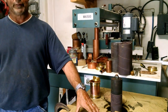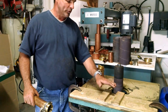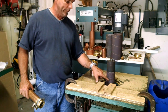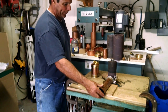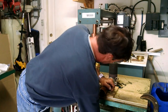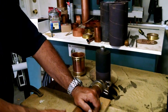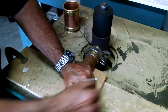I've actually made a jig for this oscillating sander. These cleats I put on here are perpendicular to this drum, centered up under this drum. I've got a line here that's centered it up. So I'll set that thing right on there like that, and as I continue on and start to put a little force against this thing — I'm going to show you when I turn this on — it will actually force some pressure against this oscillating sander and it will slowly start taking material away, as you can see.